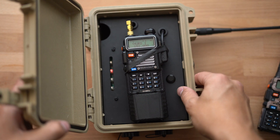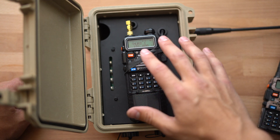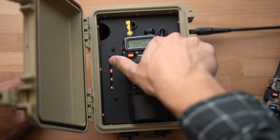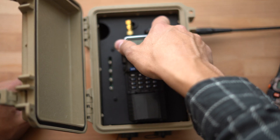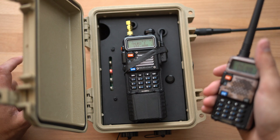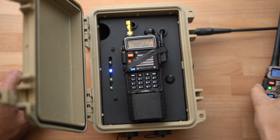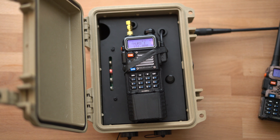To prevent this, make sure the ranger band is seated nice and high on the neck of the plug, then give it a firm press until it's solidly seated on the radio. You can also add another ranger band or replace it with something more secure — anything to keep that plug tightly seated will ensure it retransmits your signal. Radio check, one two — and now it is retransmitting my signal just fine.